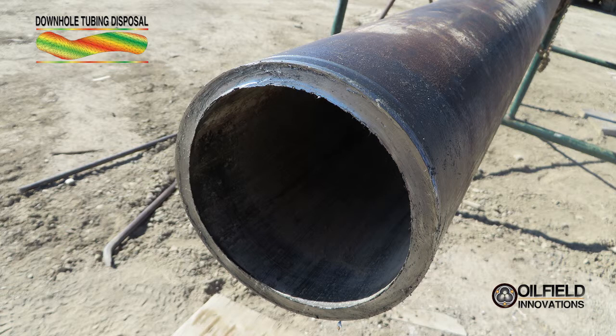We were very excited about the results of this testing because it helped disprove a myth that API tubulars were somehow stronger than other steel tubulars, when in fact they're virtually the same — it's just that the API tubulars have a much thicker wall. It is therefore possible to buy off-the-shelf plumber's cutters to cut API tubulars, provided they have enough depth to get through the wall thickness of the tubing.